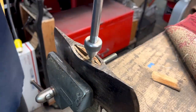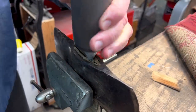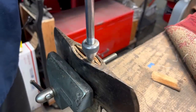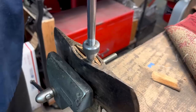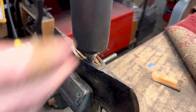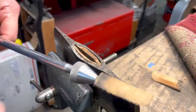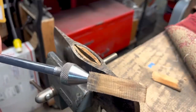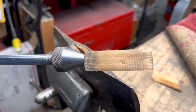We go again. We drilled a small hole there. Screw in the slide hammer here till it gets pretty much bottomed out. And then we'll slide this weight up. Oh my God. That is just phenomenal. So that's how you pull a wedge out using a slide hammer. How great is that? I love you subscribers.